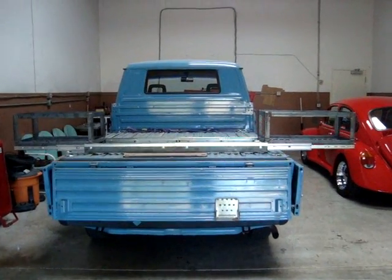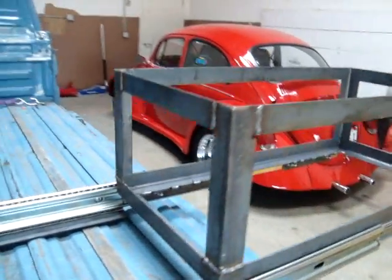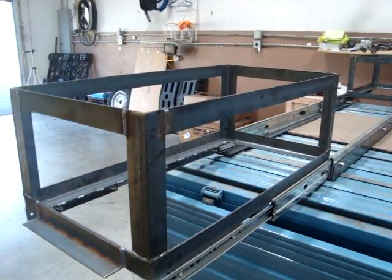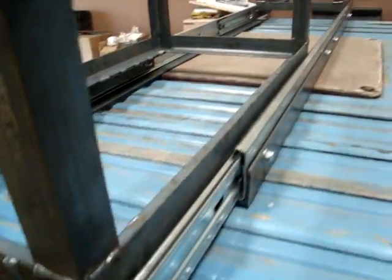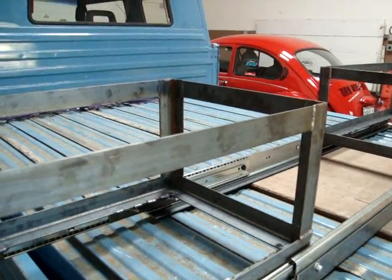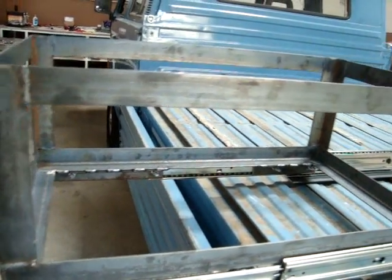We'll zoom in and take a closer look at our battery racks. The 38 cells in this conversion will weigh 475 pounds. We will be able to slide these in and out. Like I said, 475 pounds, and these glides are good for 350 pounds per side. So no problem there getting this to work. It's a 3-section slide. This is made from 1/8-inch stock. There will be ABS insert in there, 3/16 black ABS.